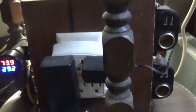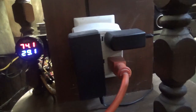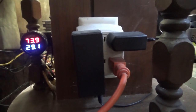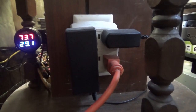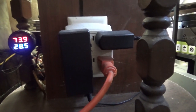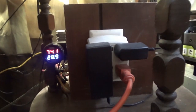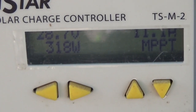We can pretty much run anything we need to here. I plugged the fridge and freezer in and it cycled for a minute — the voltage dropped down to 28-something — and then it cycled off, so it didn't need to be on that badly. The freezer had been off all night. I am aiming to get to the point where I can run everything 24/7. It just cycled on — 28.9 volts. Let's run out and see how many watts we're pulling off the solar panels.